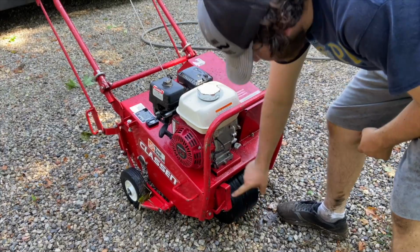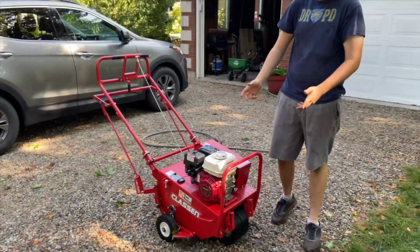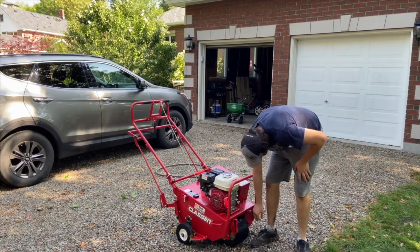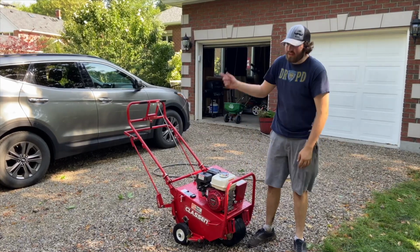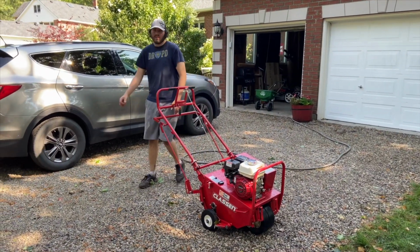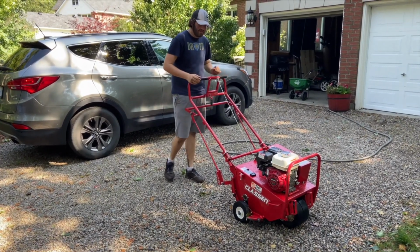back in. Those are really good to remove if you're lifting it in the back of a pickup truck, because it takes about half the weight of the machine out. So if you're putting it in the back of the pickup truck, take out both the weights first and then lift the machine back up. Another tip, once you get it in, drop the tines down. The tines will keep it from flying around in the back of your truck.